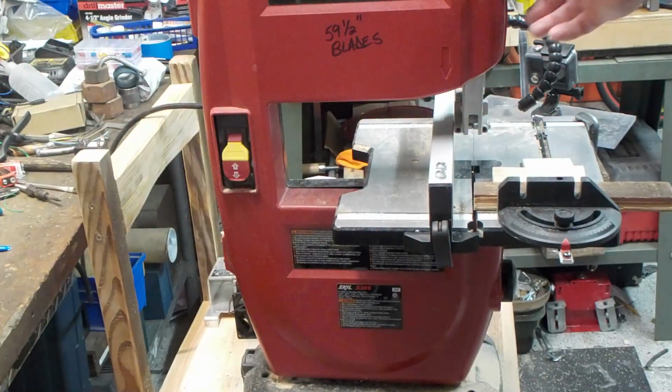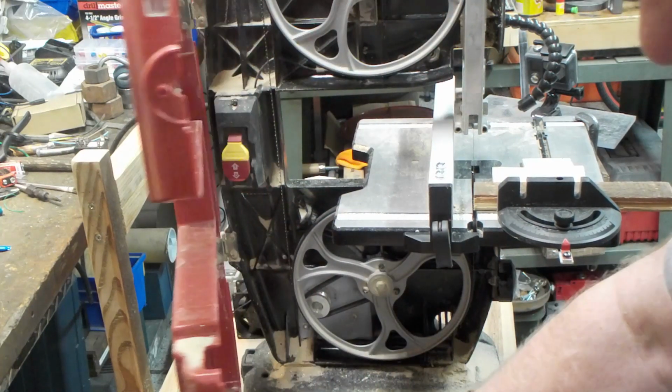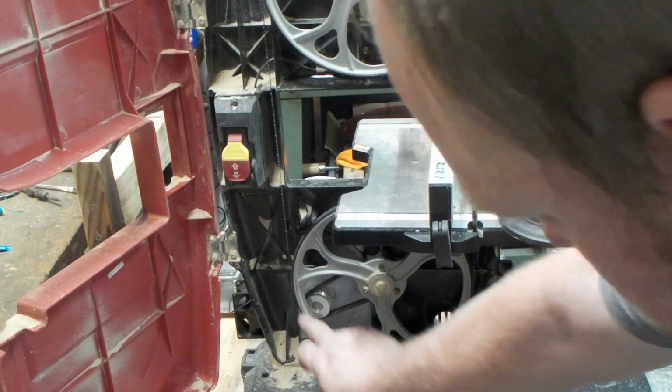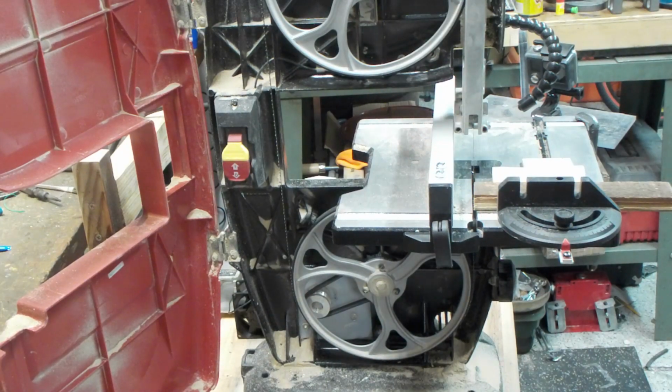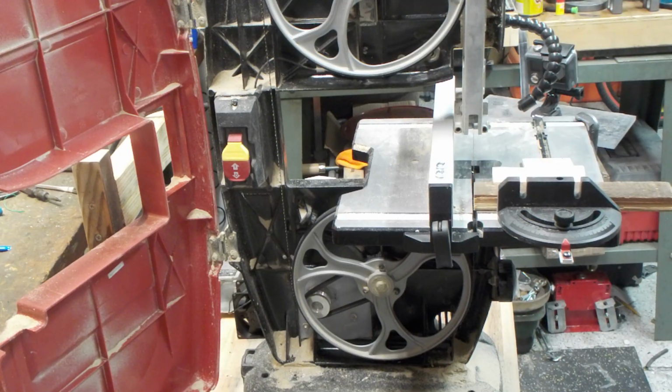Okay, what had ended up happening was there was a fairly sizable hole here to make this happen. I changed the pulley diameter, and I custom made another pulley from some 6061 aluminum. It wasn't very difficult, but I still had the problem of a big hole there, and I'm worried about dust getting sucked through the DC motor and all that.